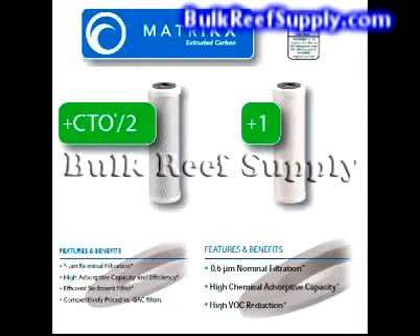For the next two stages we use KX Industries Matrix Carbon Blocks. KX Industries is a leader in the carbon block industry, and the CTO2 is actually the most widely used carbon block in the entire world. They are an American company with American standards, certified by the NSF, and made right here in the United States. We stage the carbon blocks progressively, so the first is a larger 5 micron carbon block, and the second is a smaller pore size 1 micron carbon block. This results in a series of filters that has both long life and excellent performance, and is even effective against hard to remove things like volatile organic compounds.